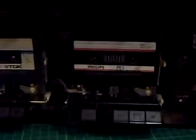Dear, oh dear. Now, I had a very similar unit to this until not long ago, and sold it to Adam, Vintage Sounds 1992. And the one difference with my unit was that it hadn't got the high-speed dubbing thing, and I begin to wonder whether it was a bit of a liability, because this one certainly took some getting going. The main belts in it are flat belts, and that was no problem getting hold of those. But like any deck that's got twin decks and one of them records, of course it's going to be the recording one that sees most use. Because if you're taping something, be it from the playback deck or the radio, then this deck is going to be going, isn't it? And of course, yep, you've guessed it, it's completely and totally worn out.